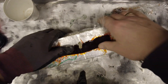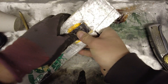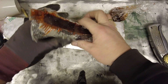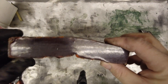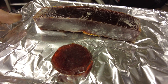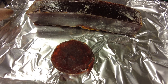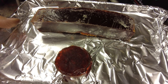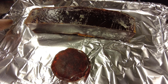I've removed the tape. I was hoping I might be able to push it out in one piece without breaking the mould. Okay, there we have it. It looks quite nice on this side but it's not so pretty on the other. Doesn't it remind you of some kind of food bar from a sci-fi film? According to the Smooth-On website, if we put this in the oven now I'm going to do it for four to eight hours at 150 degrees Fahrenheit - that's 65 degrees C. According to the website it increases the properties of the rubber. So as it's an 80 Shore rubber, I'm assuming it makes it less brittle and prone to breaking under stress, but I don't actually know because it doesn't say. But we're going to do it anyway.